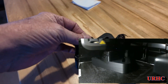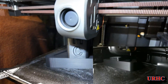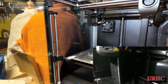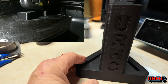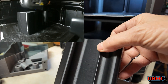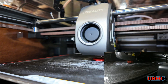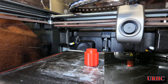The first one was a failure. I cleaned out the plug, put a new nozzle in, and went back to printing all over again. I found out there were some changes I should have looked into — you can see I've got some over-extruding on there, but the part came out good anyway. It's all five walls thick and it came out perfectly square and straight, just with a little bit of over-extruding. I should have adjusted the flow rate when I changed the nozzle.